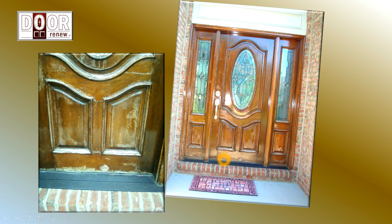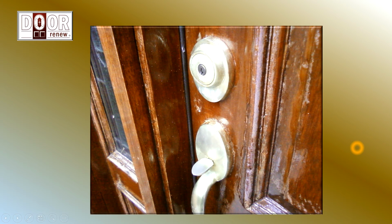that's exposed to more sun than any part of the door, and in addition, any moisture, rain that would blow against it, a sprinkler. If you're in an area of the country where snow might blow against the door, that's going to collect at the bottom. So you have a combination of the UV and the detrimental effects of moisture and water, and that can really wreak havoc with the door.